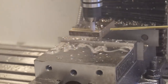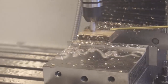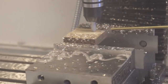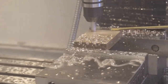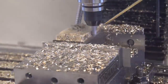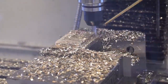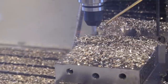I started with a face and you can see already my feeds and speeds are so much better — got chips flying all over. I did notice a bit of what could be steam or smoke, and I don't know if that's normal with a fog buster or if I'm running too hot. So I followed that facing operation up with a 3D adaptive to get the bulk of the shape of the fidget spinner out of the brass.